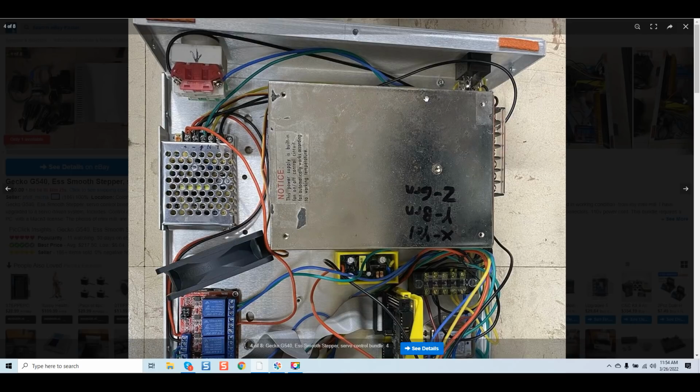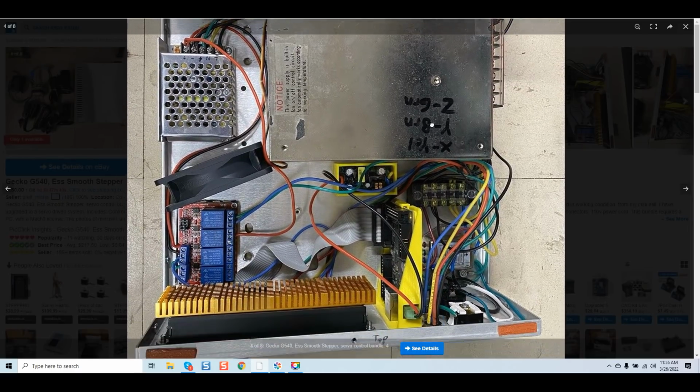Then look at the proximity of this power supply here, which again is the largest power supply powering a G540, and he's got soldered leads that are not heat shrunk. Well, look at the proximity of this power supply to those switches' inputs. I mean, realistically, this is terrifying. That's an AC side for that switch. If that metal arcs at all, for whatever reason, the switch comes loose. Maybe the guy goes to press the switch in, and maybe the nylon actual ports on the switch, as far as the supports, something gives. Anything, you could arc off that and instantly have a dead short. I mean, this is scary. It is really, really scary.